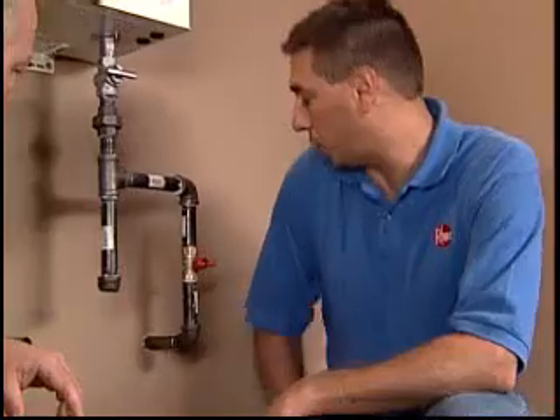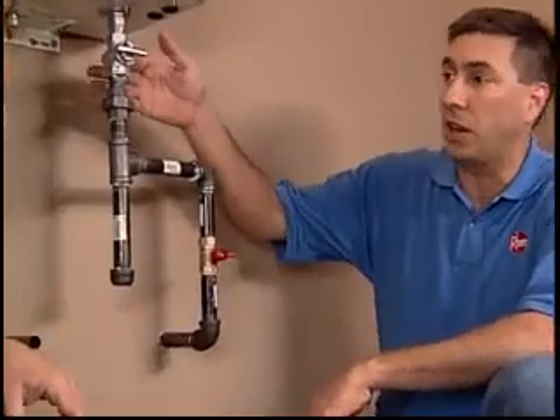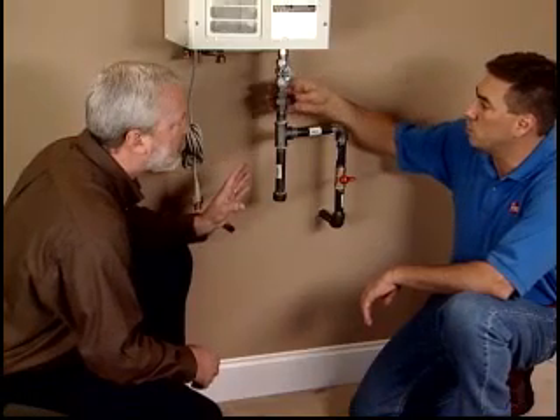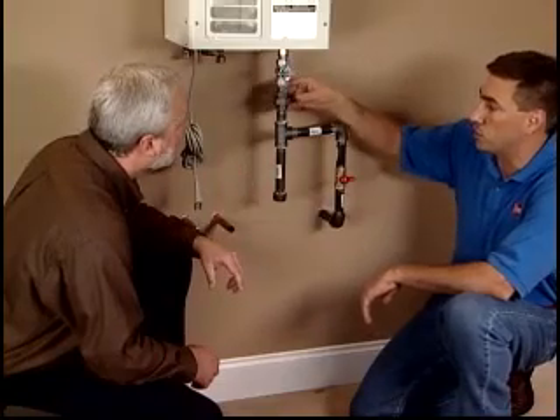You made quick work of the piping for the gas supply. Tell me about what's here on the installation. Well, it's pretty simple, really. We made sure that we've installed the shutoff valve — the gas supply shutoff valve here and here. We've also got a union. Why is that important? The union is important in the event that you want to disconnect the water heater for service. It makes it much easier.